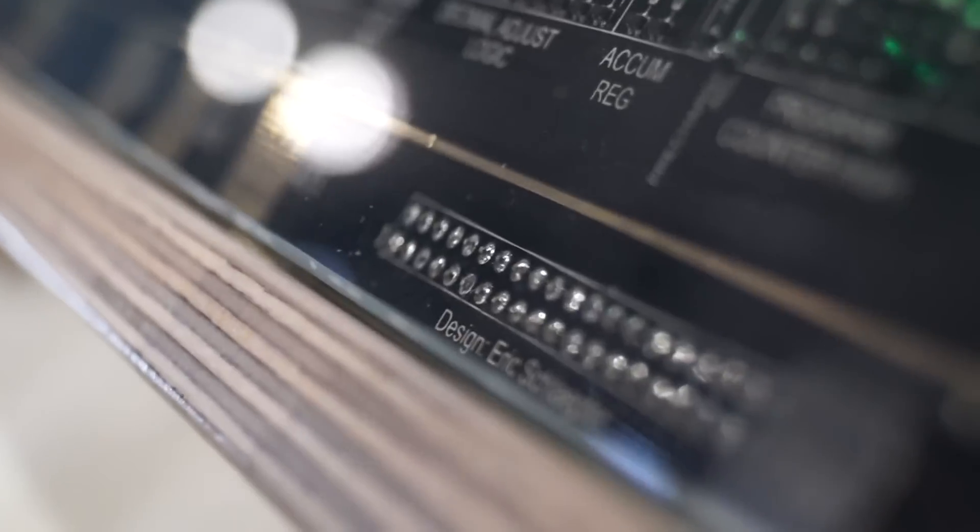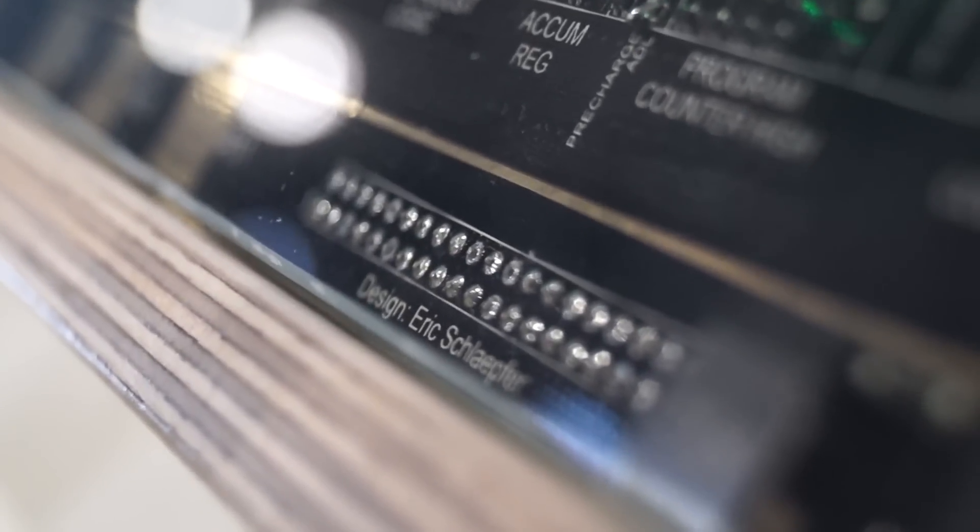There were several big problems. The biggest one is figuring out the feasibility — would this even work? Because there are so many transistors; there are over 3,200 transistors in the design. So I did a lot of experiments to try and prove to myself that it would work. I made a small program counter with a subset of the circuit elements I used in the design, and it worked perfectly. At that point I knew I had to sit down and put down the rest of the transistors.